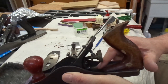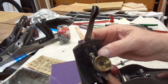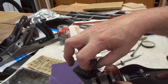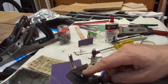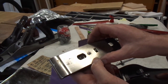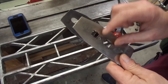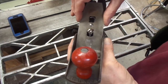I noticed little bits of brass down here, so I decided to take it all apart again and polish the edges of the yoke. I put a couple of washers — actually split lock washers, because they had better geometry — on either side of the yoke, and I still have the aluminum bushing around the pin. I also sanded the inside of the two round ears on the yoke to smooth them out — one was rounded and the other was burred on the inside. The real slop comes from up here: that's three or four turns of the screw just to go from the top of the slot to the bottom. I put a clip in the opening in the chip breaker to try to take up some of that slack, but unfortunately it just didn't sit right — oh well, it was worth a shot.